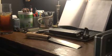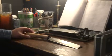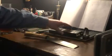And if you're doing some really light woodwork, like cutting something very springy like alder, you'd want to have the blade a lot sharper than this. And if you're doing wood whittling, slicing, that kind of stuff, trying to make fine shavings, debarking, you'd want it a lot sharper. Now again, it's not the end of the world that you had to sharpen this knife, but again, this is not a cheap knife by any means. So it would be nice if a bit more care had been taken in terms of initial sharpness. But that aside, that's the most trivial thing to fix. Rounding this off is very trivial, and assuming this blade works out, I might get a nice leather sheath made for it anyway, because that wooden one is essentially just a case that you're going to carry it around in. It's not at all functional.